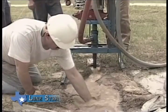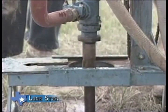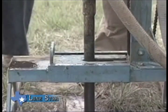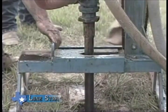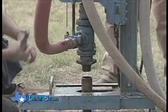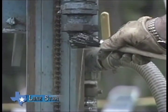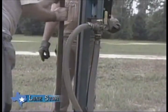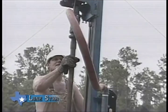When the assistant driller can no longer feel cuttings coming out of the borehole, the driller diverts the mud flow back to the pit with the three-way valve, raises the pipe to clear the breakout lugs past the table, and the assistant engages the slips. The driller then lowers the drill pipe so that the breakout lugs engage the slips, and the assistant, using the hex spanner on the breakout nut, rotates the quill counterclockwise until the pipe drops free. The driller raises the rotary to the top and dopes the quill pin for another joint of drill pipe. The assistant dopes the pin of the next drill pipe, threads it to the one suspended in the slips, and prepares to pull the slips while the driller stabs the rotary threads and raises so the assistant can pull the slips.